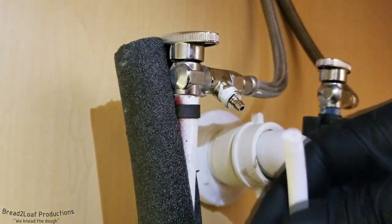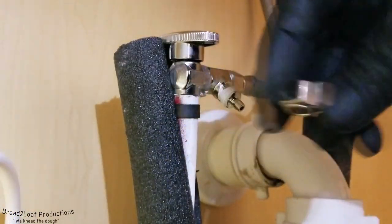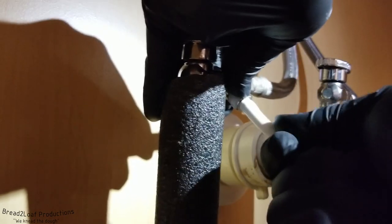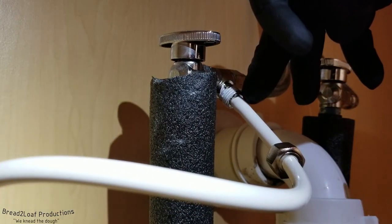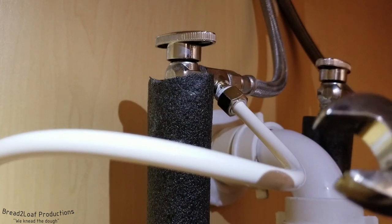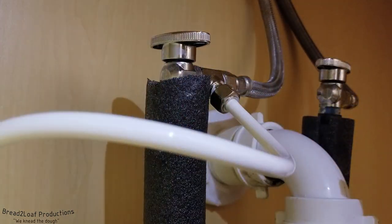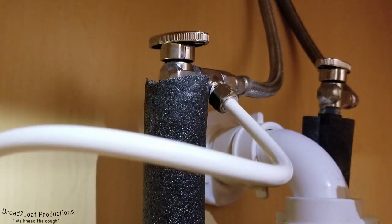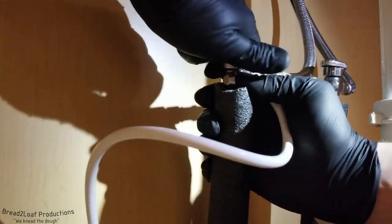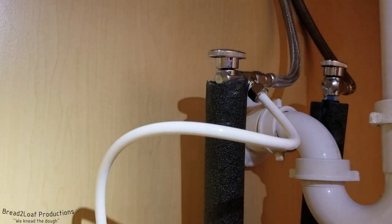Extra tubing out of the way. The last step is to connect this barb and this hose together — it snaps on. Then make sure you have your compression nut with threads facing in, slip it over the barb, and make sure it's seated completely against the threaded portion. Then take your nut, slide it up over top, and screw it down. In my case this is a 16mm. I think this is the moment of truth — let's see if there's any leaks. Well, that's encouraging. I don't hear any dripping water or screams from the apartment down below. So I think we're good.